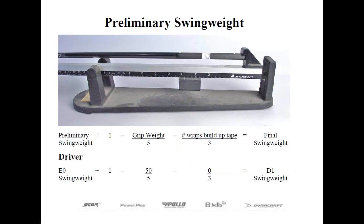Now it's time to use our swing weight scale. Let's say you're at the stage where you've cut the shaft to length but haven't yet epoxied it in place. There's no grip installed yet, but we know the grip cap will occupy approximately an eighth of an inch beyond the butt end of the shaft. Many club makers make allowances for this by positioning the butt end of the shaft approximately an eighth of an inch from the stop on the swing weight scale — that's the stop where the shaft butts up against the scale.